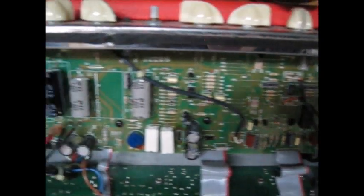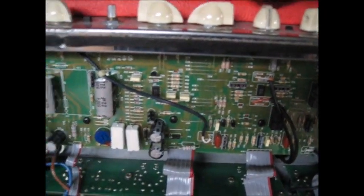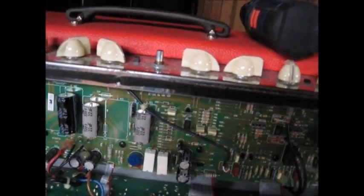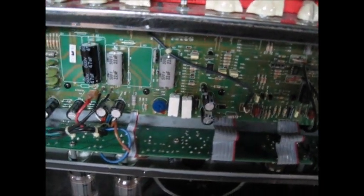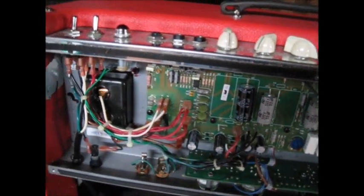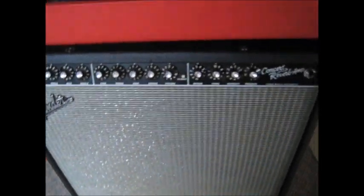It still has a lot of original stuff in there. I think the only thing that isn't probably original is maybe that resistor because it's standing up off the board. We still have the old school 5-watt resistors there — they usually get kind of crispy and want to come off. I don't see them getting crispy yet, but it'd be nice to float those above the board a little bit. It's probably just going to need some general maintenance. I think this is the Texas Red edition — the plates just rub off and you can't read the text anymore.